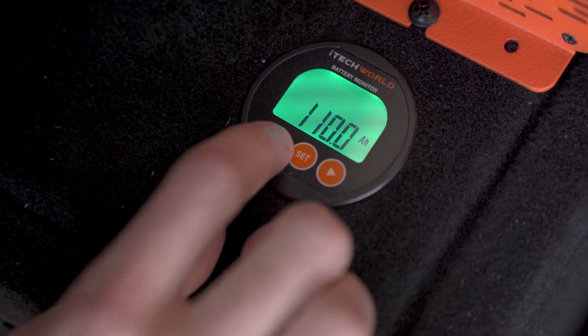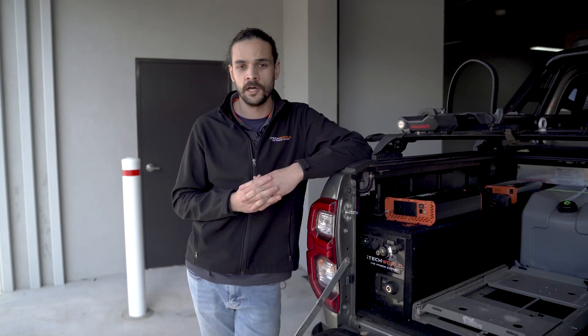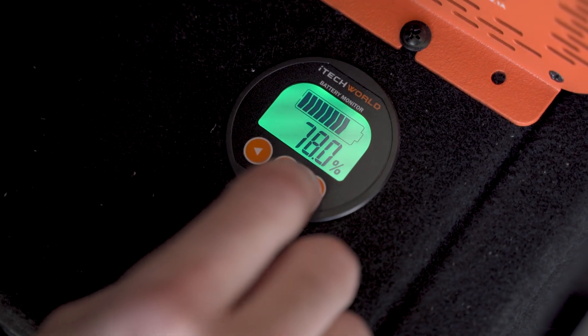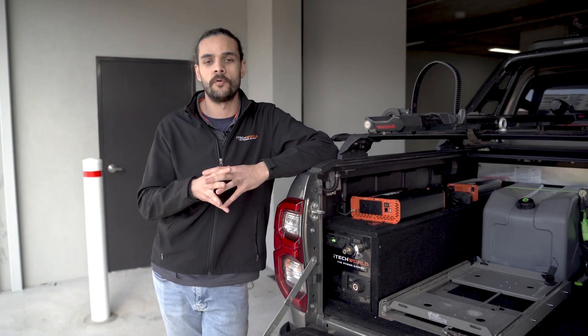The second is the available amp hours. Now that's up to you — that depends on how many amp hours your batteries have available. And of course once your batteries are fully charged, if they're one of our lithiums that'll be at 13.5 volts, you would click the right arrow, go to percentage, hold down that right arrow, spike up to 100, and that will sync all of your parameters up.